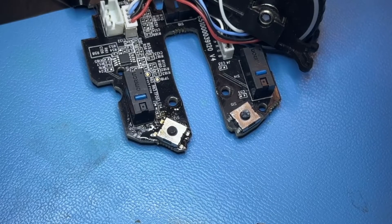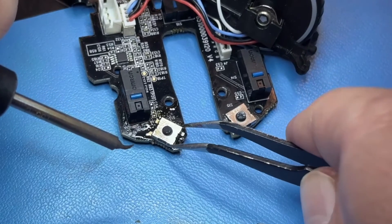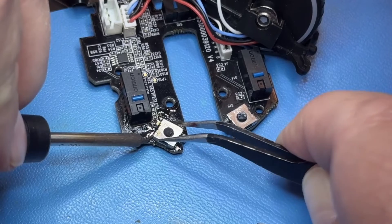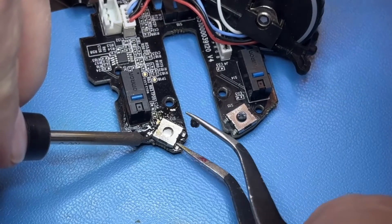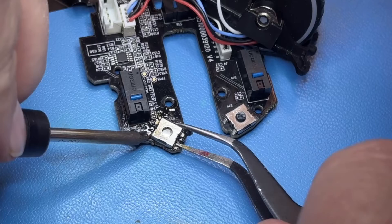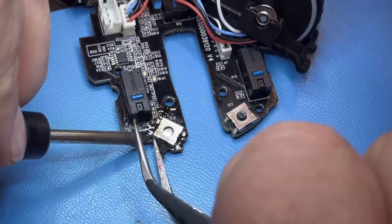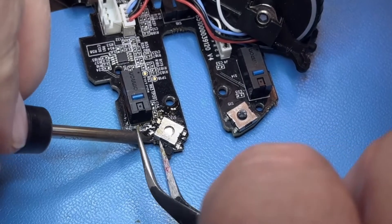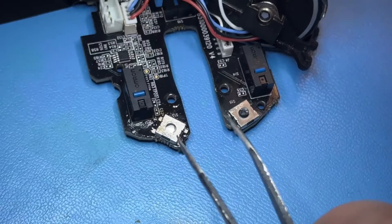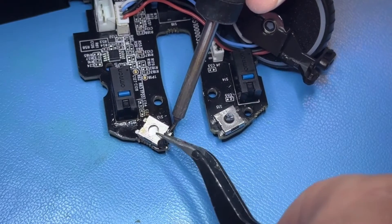After wicking I take the tweezers and give it a little wiggle — it is a little looser than before, so I know it's starting to give. I add a little bit of heat and my tweezers slipped, taking the button cap right off the switch. But I can now get underneath the switch and gently pry it, easing it away from the pad that's giving the most trouble. Eventually it just came off, and there was no damage to the pads — thank god.